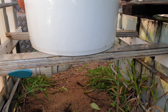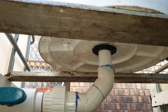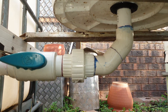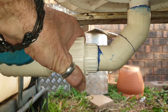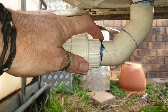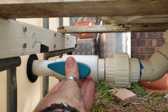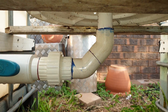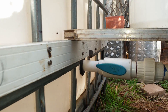The whole system will be cladded from the sunlight in the near future once we work out how everything else is going. Down underneath you can see the uniseal, and I've got all glued or screwed fittings — 25mm or 1-inch pipe coming down to a double 45, connected to a barrel union — a 25mm barrel union — into a 25mm valve with a handle. I love these sanking valves; the handles come off so no one can muck around with them, which matters as there'll be grandkids involved. The water you can see leaking down here is probably coming from that crack. That's all the plumbing through the uniseal into the base of the aquaponics fish tank.